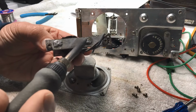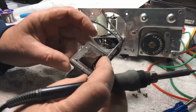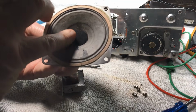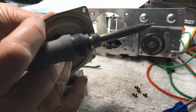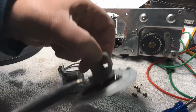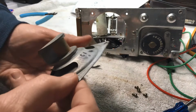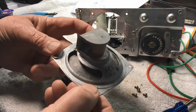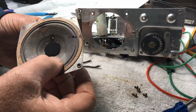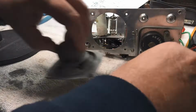Looks okay, but initially I thought it was a little bit crunchy, a little bit the voice coil catching, but probably not. Just checking the transformer there. The speaker, as I've said, has a couple of little holes in it that need some liquid electrical tape on them. So I will be patching him up and checking him out fairly soon, possibly on the next video. I hope we don't have to find another speaker that suits, but anyway, I do have one of these wrecked for parts, and the speaker is good in it, so we do have some spare parts.